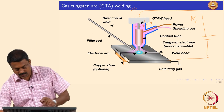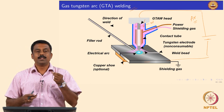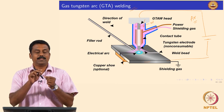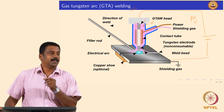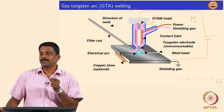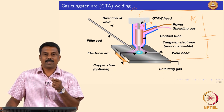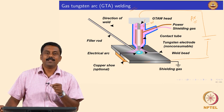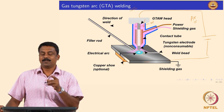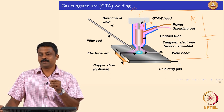It is very simple — I just brought this contact tip setup. This is a tungsten electrode and the red color here means a lot. This is painted red, which means it is thoriated — it contains 2% thorium oxide. We use color codes to identify electrode composition; red at the top means 2% thorium oxide containing tungsten.